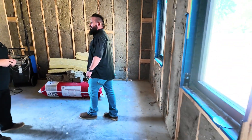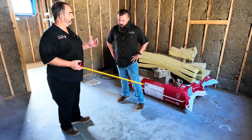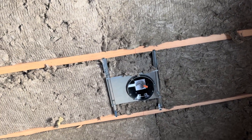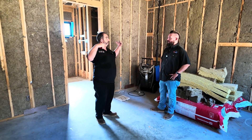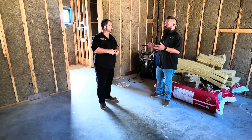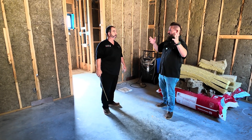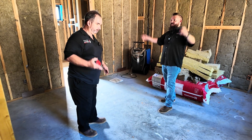So here in the master suite area, this is a good example where I used the existing lighting diagrams from the engineer — I didn't mess it up, I just replaced lights with our device. This one is a return, the one behind you is a supply, then this one over here is also a supply. I need a little bit over 100 CFM, so one wouldn't quite do it. This way you'll never hear it running, but now you've got the perfect airflow. So I've got one return and two supplies. What's cool is that since they are lights, we sell dummies that don't have to be hooked up to a duct, but they still maintain the same aesthetic — they look identical to the supply and return units.